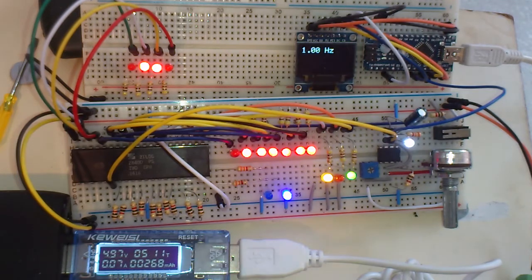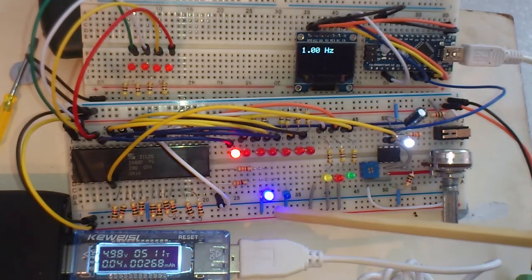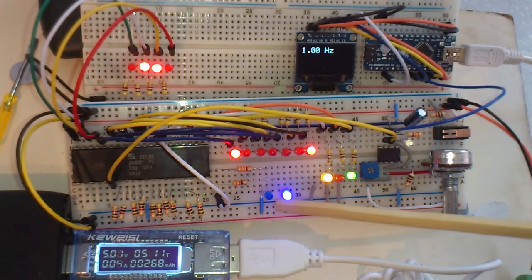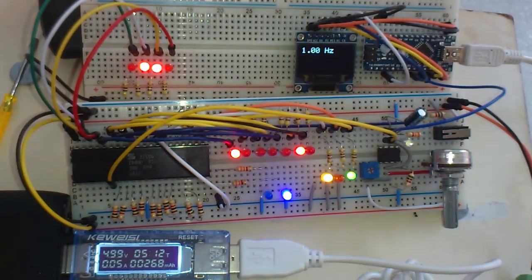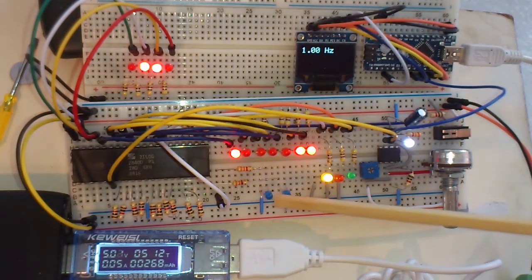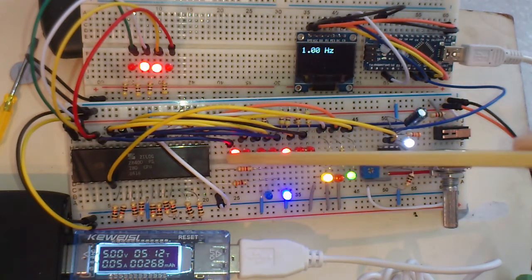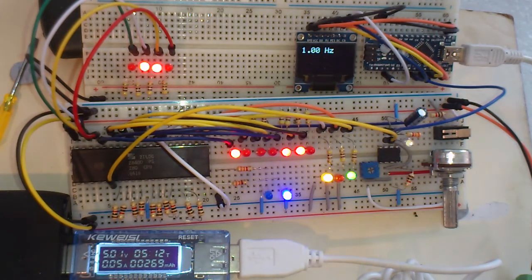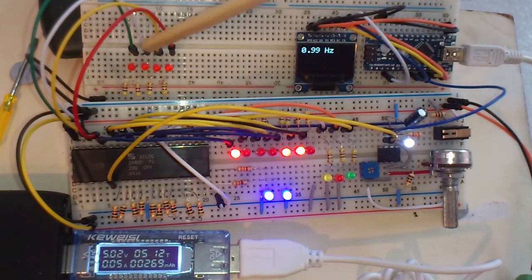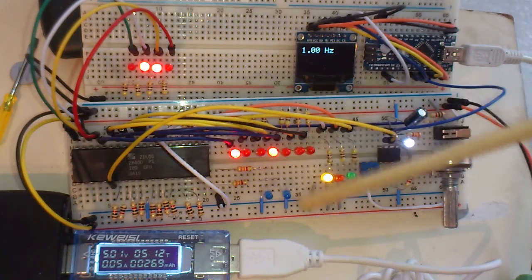What's going on there? Well, this is to do with the refresh mode of the Z80. The Z80 would use 2 cycles to read from dynamic RAM, and it would set the refresh pin active when it wanted to do a read from dynamic RAM, and it would use the lower 7 address bits to specify an address from dynamic RAM, and it didn't bother using the rest of the address bus, so these would all go inactive, and I guess that saves a bit of energy.